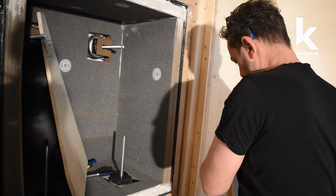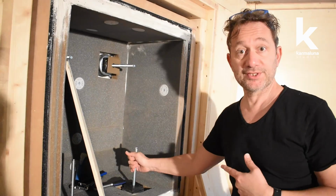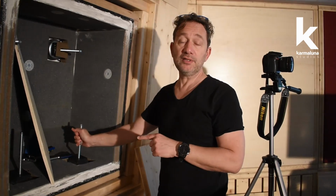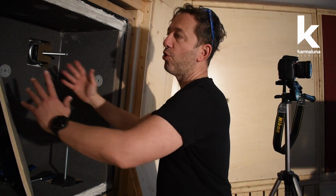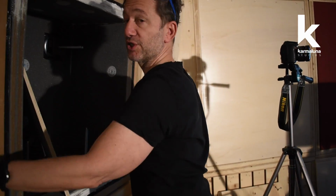So of course you cannot just put any decouplers. You need to calculate them. We have an amazing acoustic engineer that is calculating. This is special material that cuts off certain frequencies. So this is done through calculations, and of course the room is important, the dimension, the volume, the kind of speaker you have, so there's some engineering inside there. You cannot just put any decouplers you want, and this is all made so, if I understood correctly, all the energy of the sound will go towards the listener, and nothing will actually be transmitted to the structure.